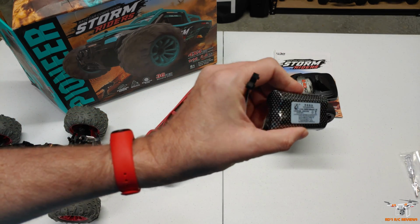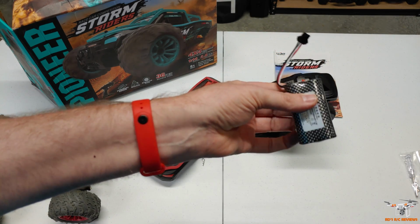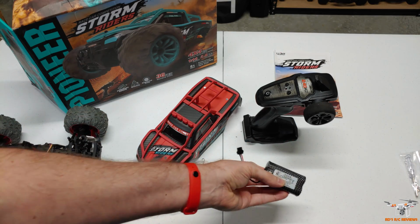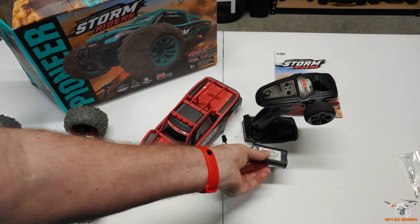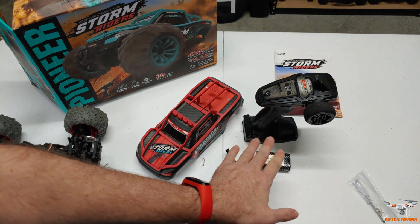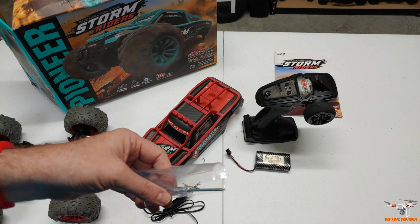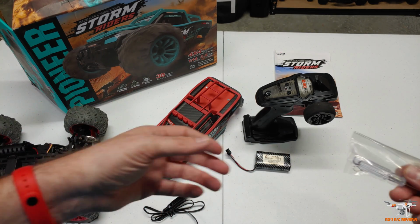I have other ones like that I could swap in here if I want to use a battery pack that I know I can balance charge, so that the battery is getting a proper full charge. And not only that, it will help the battery last longer if you are charging it fully but not overcharging it, or getting it way out of balance. That's the worst thing, when they get really out of balance, where you have one that's much higher voltage and one much lower, because it's not using a balance charger.